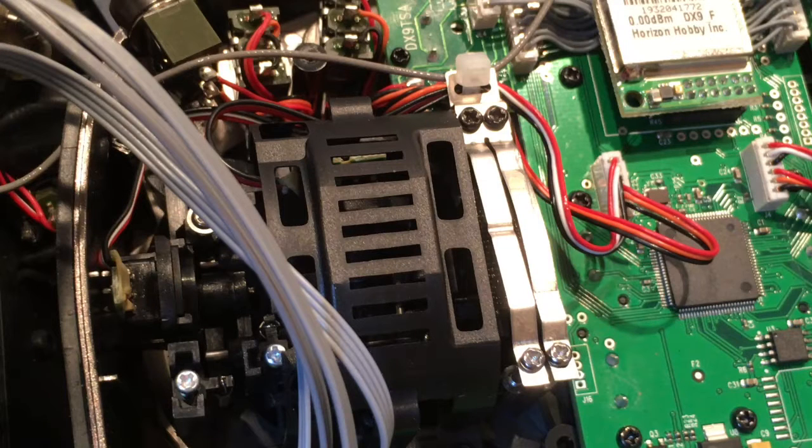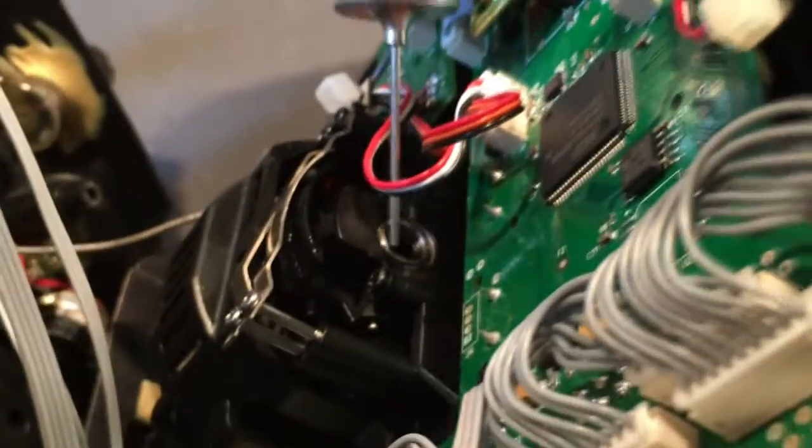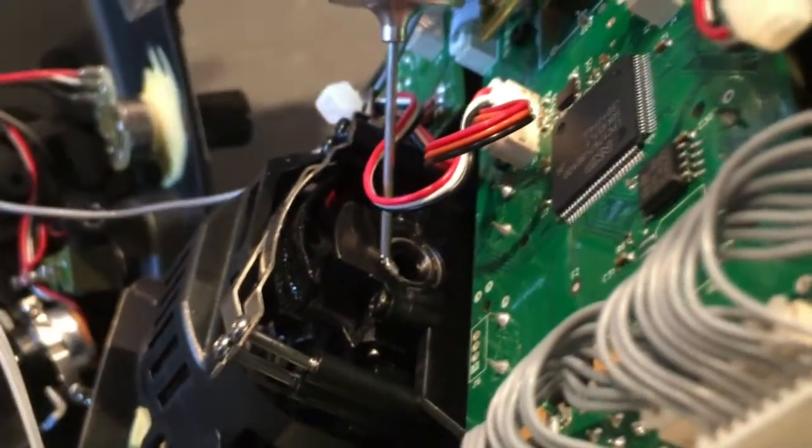The friction bracket is split into 2 pieces, a ratcheted side and a non-ratcheted side. Since I'm a helicopter pilot, my cyclic stick has no friction applied and certainly no ratcheting applied, so I leave them loose. Now take some bearing oil and apply some between the inner and outer race of each gimbal bearing.